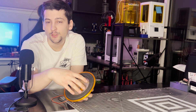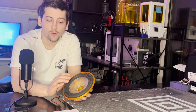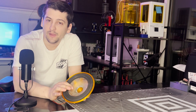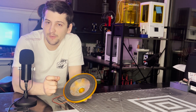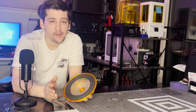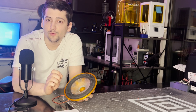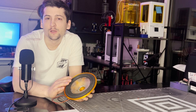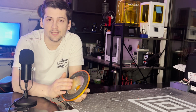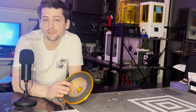I did a significant change on the cone. The cone is now going to be printed on resin printers. I went from having 1mm to 2mm thick cones weighing well over 20-30 grams down to a 0.2-0.3mm thick wall cone on this. So a lot of reduced mass in the moving pieces of this speaker, which I believe helps drive efficiency up.